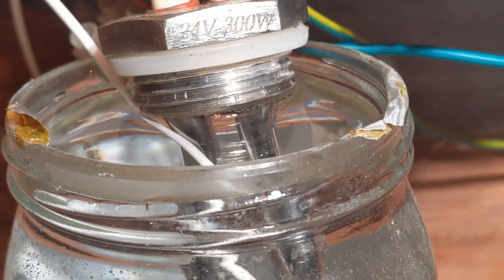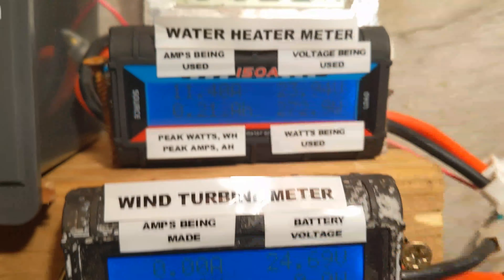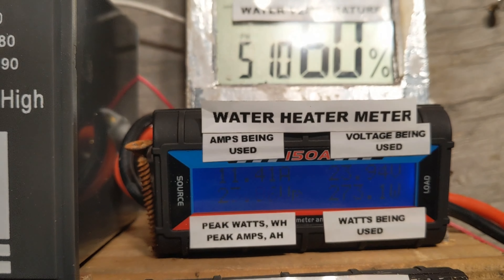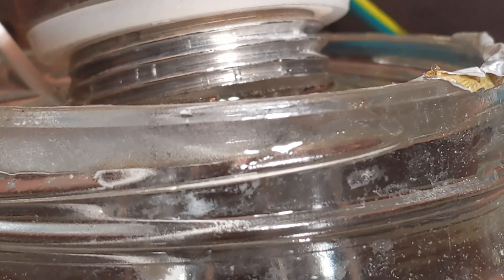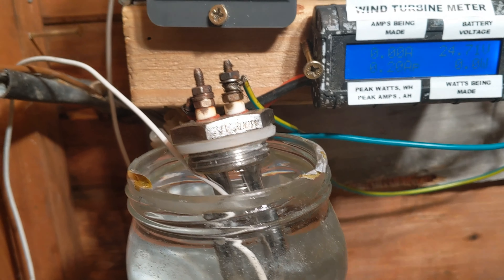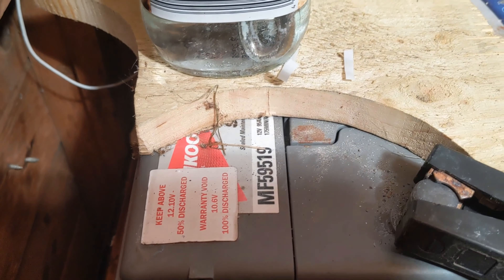A little flicker. You can see the bubbles. It's gone down to 24.68 — that's acceptable, I want to keep it above 24. Clocking away at 11.41 amps. The amps stay pretty stable but the voltage does vary. Actually, it looks like it's stabilized now, it doesn't seem to be moving around. Definitely bubbles. These batteries aren't bad — this one I got for 25 quid. That's really good.